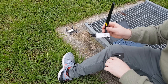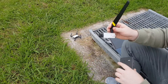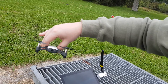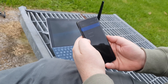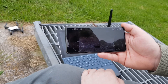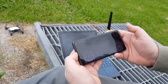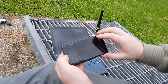I'm also using the antenna from my home router, which is a very powerful antenna rather than the one the dongle comes with — this works much better. The next thing you want to do is turn on the drone. Once it's on, connect to the drone with your phone like normal. Once connected, switch to video mode so it's in 16 by 9 and running at the highest resolution. By default it's in photo mode, so switch it to video mode first.